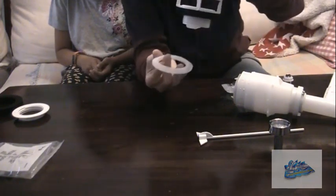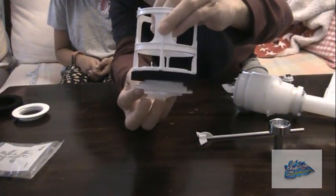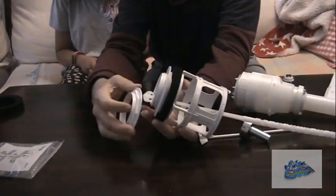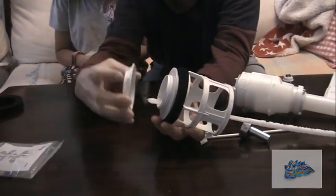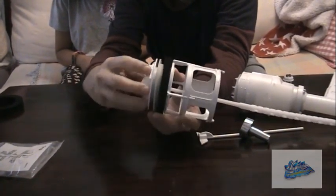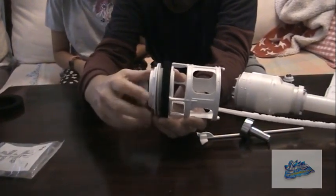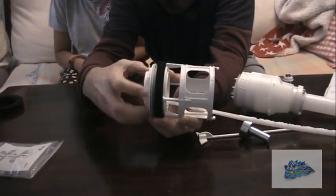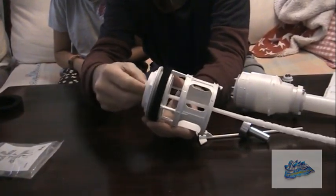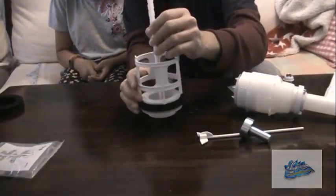Now, underneath the cistern, we're going to put this piece on with the lip facing up. That's going to slot underneath. Hope you can see that going up underneath the cistern. Then we have the nut, which will go on, and that will screw on under the cistern there. Put that on and nip it up good and tight, probably just by hand, I would say. And we're left with that inside our cistern.